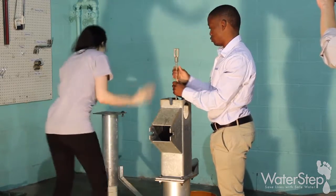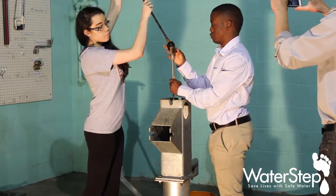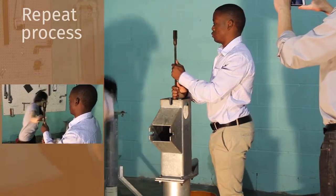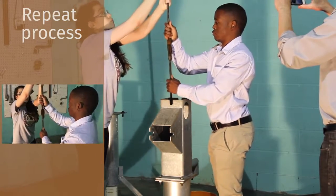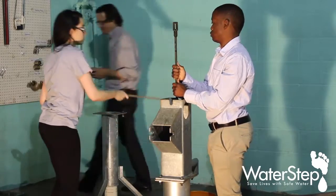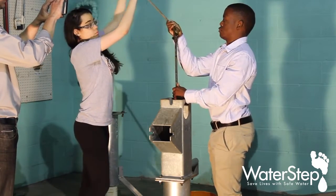When you get as far down as you can go, you pick up the sucker rods that you have just removed, reinstall those just like reversing the process, and lower this down until you reach the bottom check valve. The removal tool is longer than the bottom sucker rod that had the top check valve on it, so this will allow you to reach all the way to the very bottom. As you put the pieces together and slowly lower them, you will come in contact with the loop that is on the top of the bottom check valve. It may not line up exactly right when you first go down.